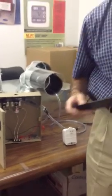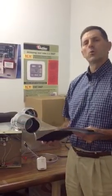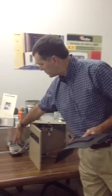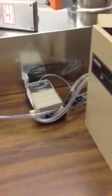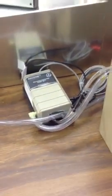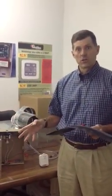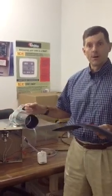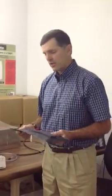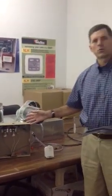A lot of people ask, is the pump noisy? Well, here's the pump — it's really an industrial version of an aquarium pump. It puts out both pressure and vacuum. It's very quiet. It has relays that tie into your system so that the pump only runs when the heating and air conditioning system runs. Any little noise that it does make is really obscured by the fan, because the pump and the solenoid panel are usually located down next to the heating and air conditioning unit.